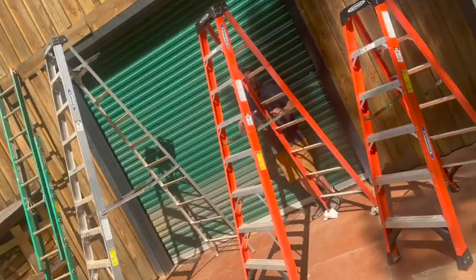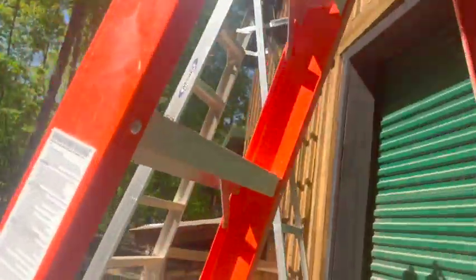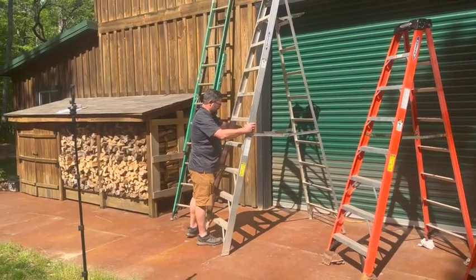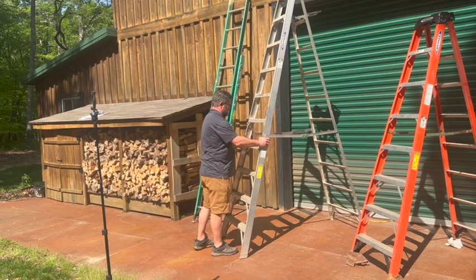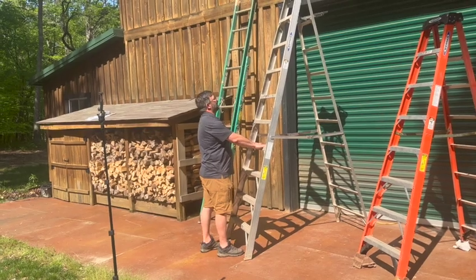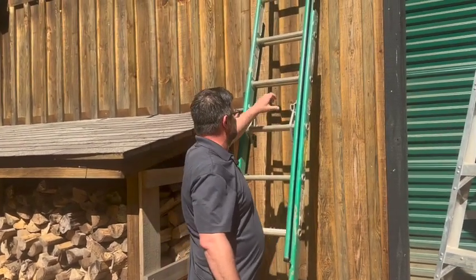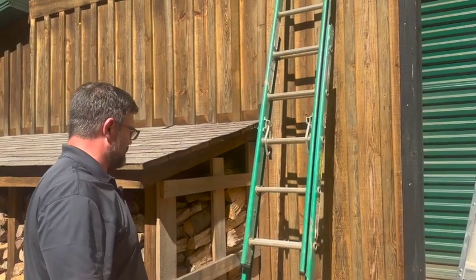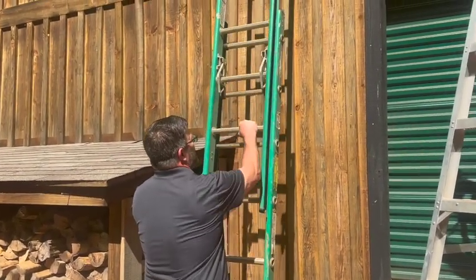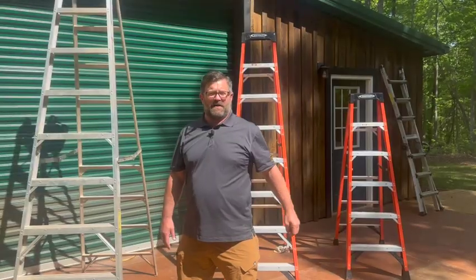There's a nice little nest up in this ladder — that's a perfect thing to inspect beforehand. Get rid of that before you get up on it. Same thing with this 10-foot aluminum ladder. I've always struggled with this one to get it secure, but take the time to get it right. For extension ladders, my biggest concern is making sure rungs are secure. Nothing's worse than putting a hand or foot on something and it rocks on you. Make sure the locking mechanisms function and you've got a nice firm footing and setup. That's ladder safety tip number two — inspect before and after each use.